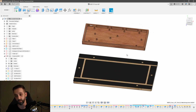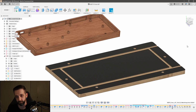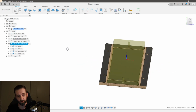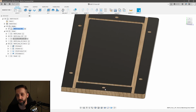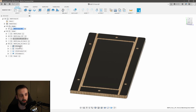And so both a little bit in my CAM and in my setup on my CNC. So that's why I ended up setting my zero point, because I came back in here and the only thing I could really zero off of at this point, because I didn't have that perfect alignment anymore, is I needed to measure off of the model itself to hopefully guarantee that I was in center, because this reference point is only good if I'm lined up with these dowel holes. But since I'm no longer lined up with the dowel holes, I had to measure off the part itself.